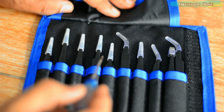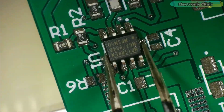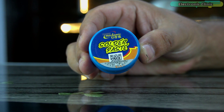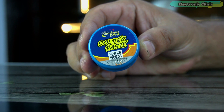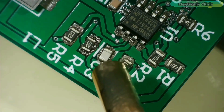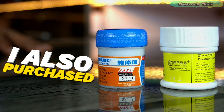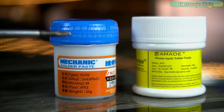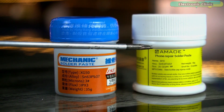You should also have high-quality non-magnetic HD tweezers, which allow you to easily place SMT components on the PCB. When purchasing soldering paste, check carefully to make sure it is not expired. The mechanic soldering paste is one of the best brands, but I was once given old, completely dried-up paste. I bought two fresh soldering pastes, both rated at 183 degrees Celsius, and I'm going to use the one that performs best.